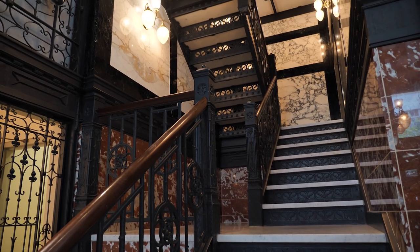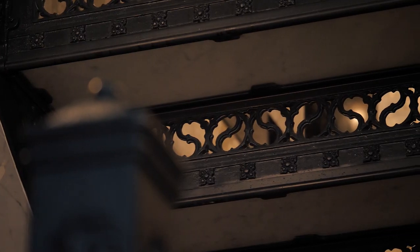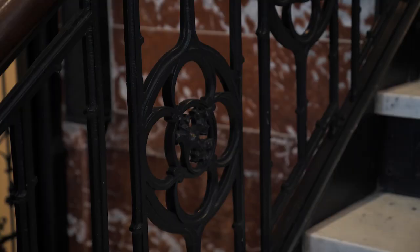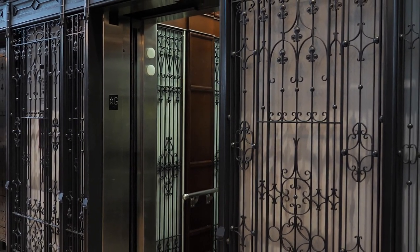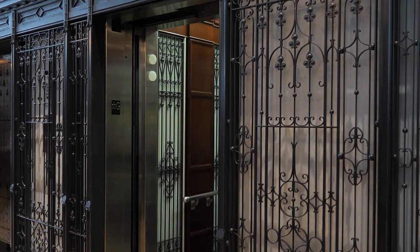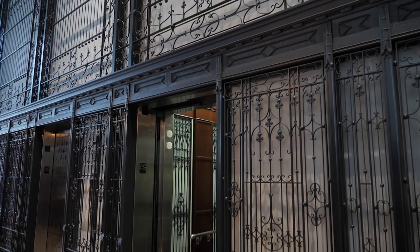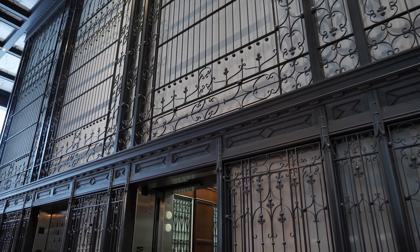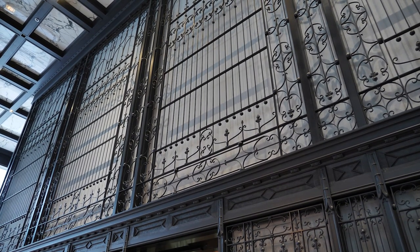That stair is cast iron, but in this case we were able to make molds using cast aluminum to recreate it in a cheaper material that's easier to work with. The elevator lobby over my other shoulder was also recreated using historic photographs and historic drawings. We were able to reproduce the grill work very accurately, but for modern codes we have to enclose the elevators themselves, so we put a solid wall behind the grill and used a colored textured wall covering to give the sense of light and openness that would have originally been in this space, with light filtering down from a skylight at the top of the elevators.